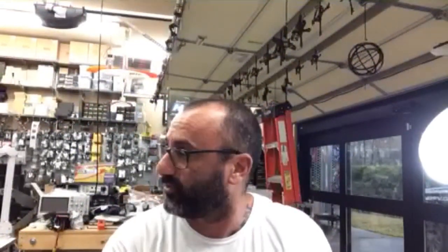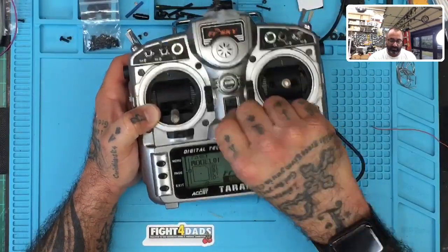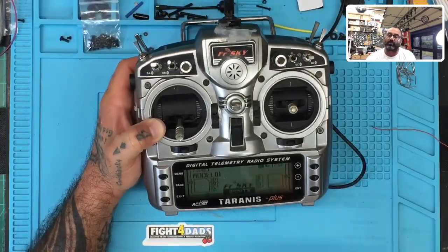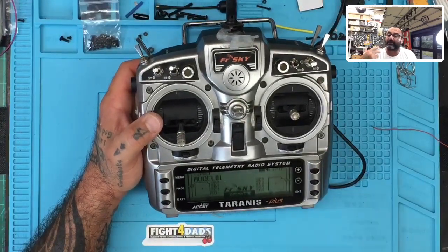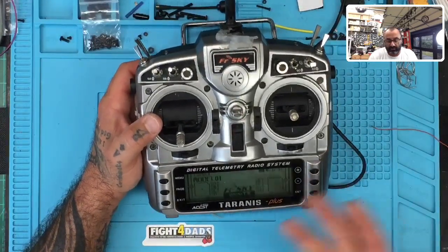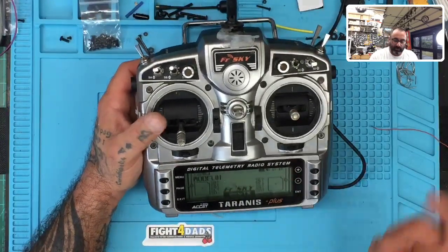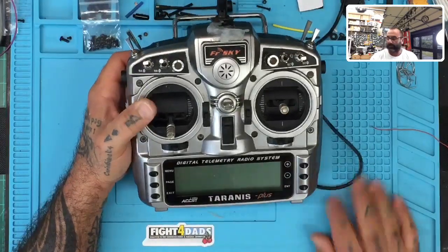It's a great workaround. You can leave the switch on all the time and it won't matter. You'll see how the switch is broken — right now you see it on, and when I flip the switch nothing happens. There's a problem between the board and the switch. I already replaced the main board, tested it, and found the same issue. I contacted FrSky to verify and they did confirm it. But honestly, for the age of the radio, it just wasn't worth spending that kind of money. So you just come over here, flip the switch off, and you're done — the radio is off and you're good.